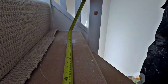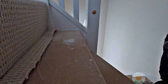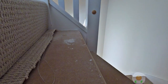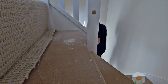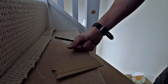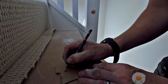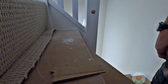With the stairs, we measure the width of each stair and take away a centimetre, so we have five millimetres on each side to tuck the carpet. What I like to do is find a bit of cardboard or paper so I can write down all the sizes, then cut all the pieces of gripper in a separate room so I'm not carrying gripper up and down the stairs and trying to cut it on the stairs themselves.